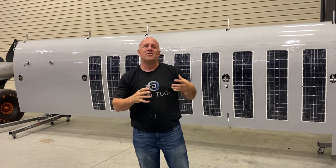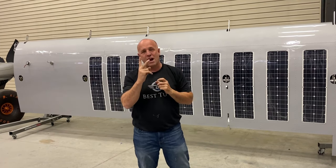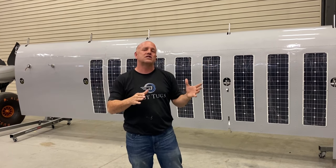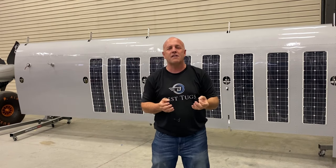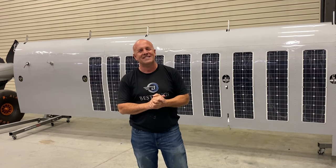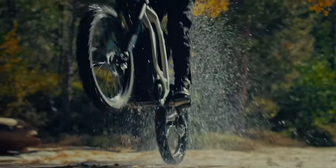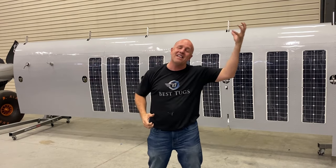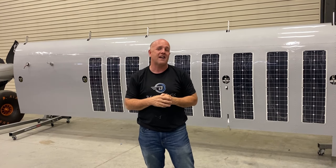I was holding back. One of the reasons I have dual struts on an aircraft that has a metal wing is because of two primary factors. One, as soon as I put the solar panels in, you lose part of that upper skin integrity for anti-twist. And so the double strut helps for that application, because I could have just added a full skin under the panel and kept that integrity, but I didn't need to add the weight when I have double struts, because I am hanging something bigger than mountain bikes under Scrappy's wings. Ron and I got 2 full-size motorcycles, full electric, and those weigh about 130 pounds apiece. And because of how heavy they are, and they're connected at the furthest front of the wing and the back of the wing, and need to be able to handle a 5G bump, I left two struts on the aircraft, even though I am a metal-winged aircraft, so that I can carry those loads.